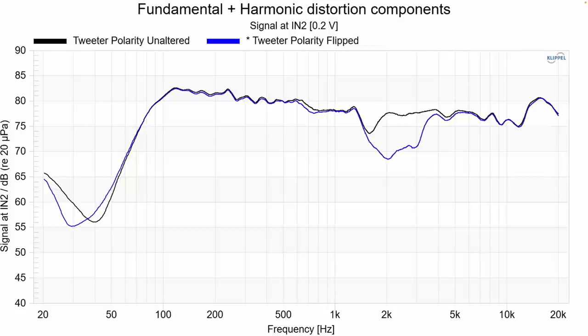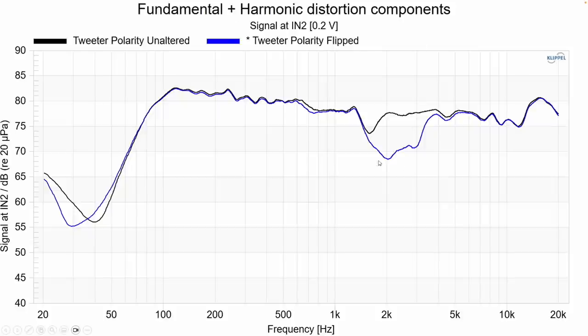I know people are going to ask or assume that the tweeter's polarity is out of phase with the mid-range — maybe wired up backward. So I tested that. What you see is the tweeter polarity unaltered in black — the initial measurement — and then I took the driver out, disconnected the wires, flipped the polarity on the tweeter, measured it, and that's what you see in blue. The polarity is actually set up correctly as-is, with this 1.6 kHz dip. If you chose to flip the polarity thinking the factory did it wrong, you'd be making a big mistake — you'd suck out a whole lot of energy from about 2 to 3 kHz. Don't do that. My best guess is there's a notch filter of some sort in the speaker bringing that down, and we'll see evidence for why I think that below.